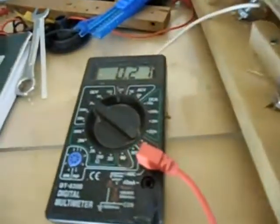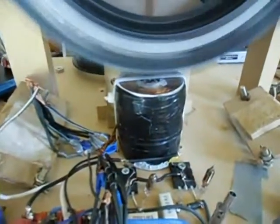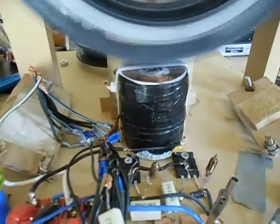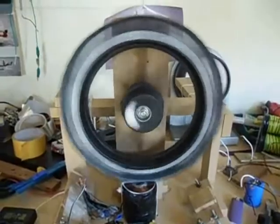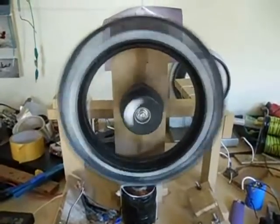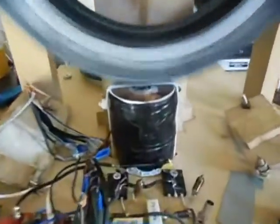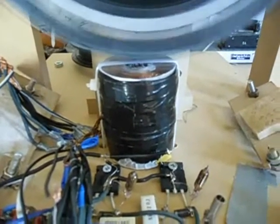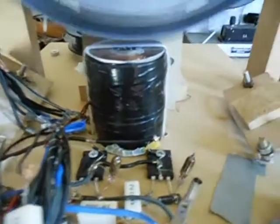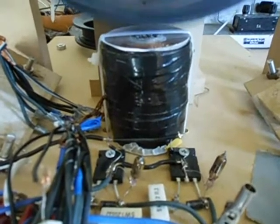Now it's only using 270 milliamps, and it had one big coil. We combined both coils into one big coil. Ten magnets, all super-coiled. And this one big fat coil is nine strands of wire, all together in parallel, and the total resistance is about 0.3, maybe 0.35 ohms.